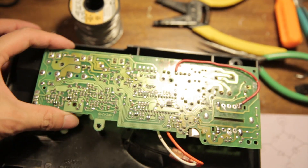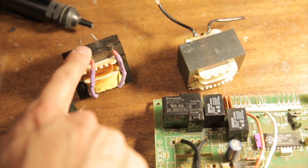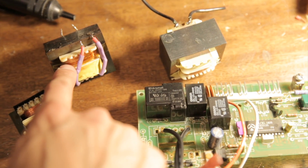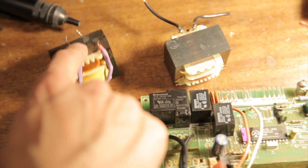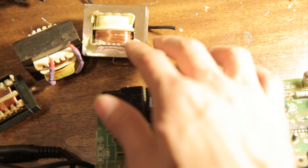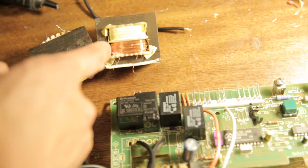There's plenty of room in there. This is the original transformer — it burnt out. The replacement I modified by taking out some windings worked for a short while, but it was erratic. Eventually it got really hot and burnt out too. I think the primary burnt out. I did it again and it burnt out again. I realized I can't just rip open the insulation and take out windings without putting the insulation back, which makes it really hard.